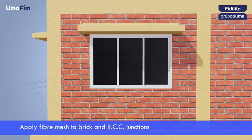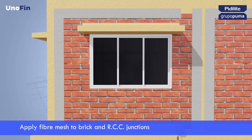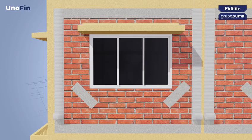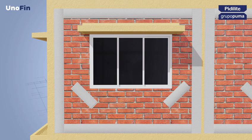Before rendering, place the fiberglass mesh around the frames, columns, window-blind boxes and in all joints between different substrates. This will prevent any stress cracks in future. A fiberglass mesh should be placed diagonally at the window corners. Make sure the mesh is anti-alkaline and suitable for the render.